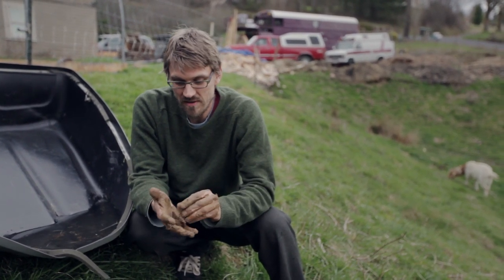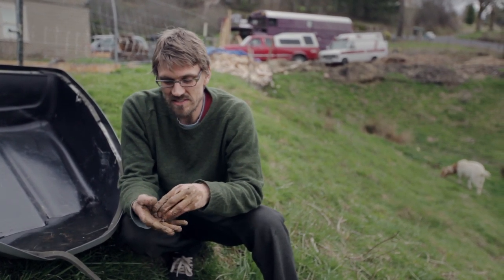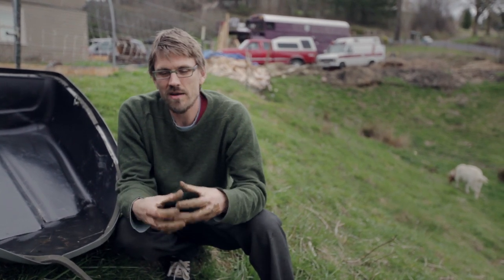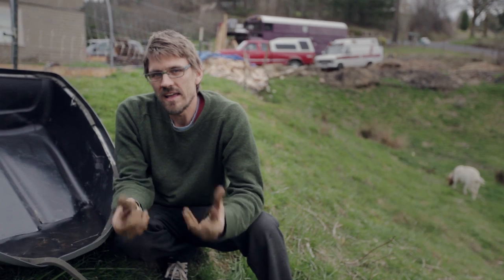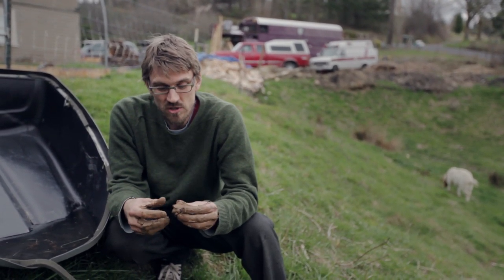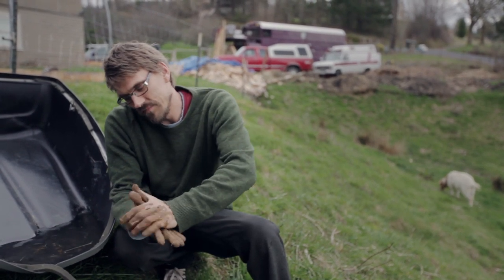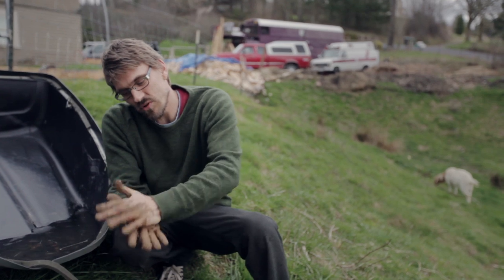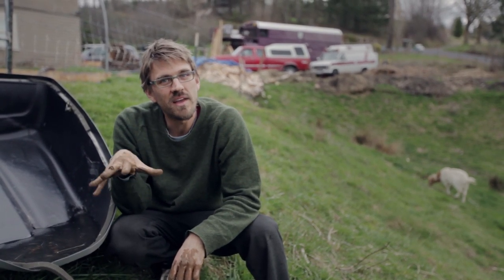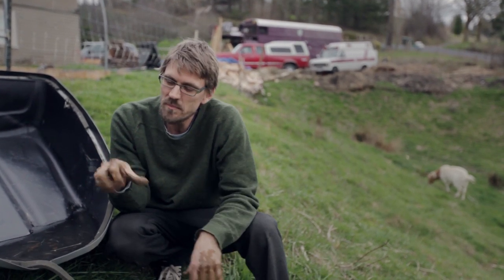But for building with cob, you want to know that it has enough clay so that it sticks together. Really the best way is to take your soil, make a block out of it and let it dry, and you'll see if it works. But right now, for the field test, we're just going to see how sticky this feels. A rudimentary one is you get enough moisture in there and you do this 10 times. If that thing sticks, you know, this is just a little field test. But this kind of gives you an idea.